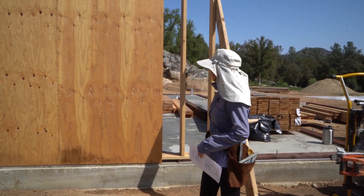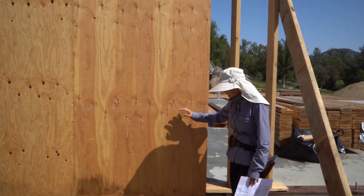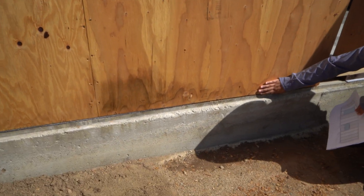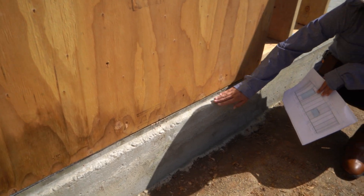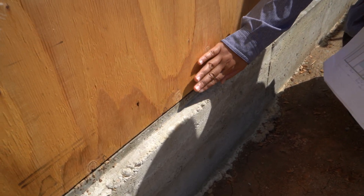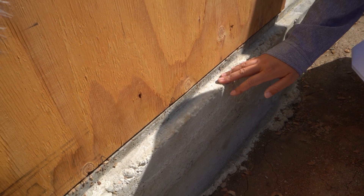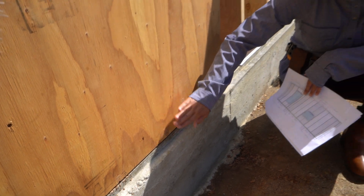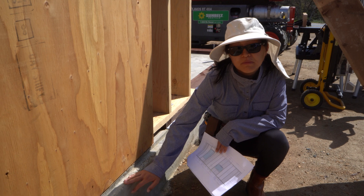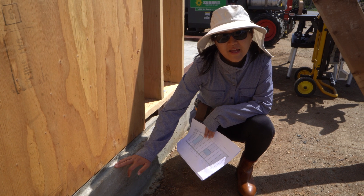Here I am at the front door — this is an opening to be cut out later. Under the sun, you can see the detail of our brick ledge a lot better. The intent has always been to hang the bottom of the sheathing at the same level as the concrete foundation itself. We'll then have a waterproofing layer that comes down past the sheathing to the brick ledge, so if water does penetrate behind the siding, it will follow that waterproofing layer and drain down and away following the brick ledge. This worked out exactly as we had intended and we're pretty excited to continue and finish all the walls.